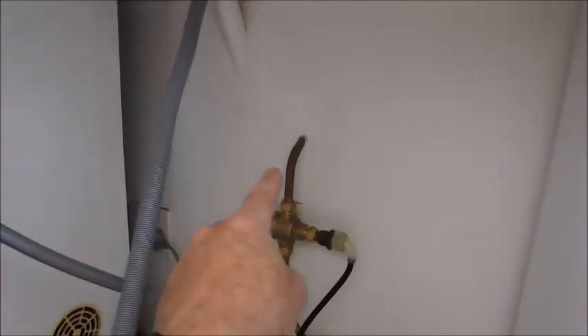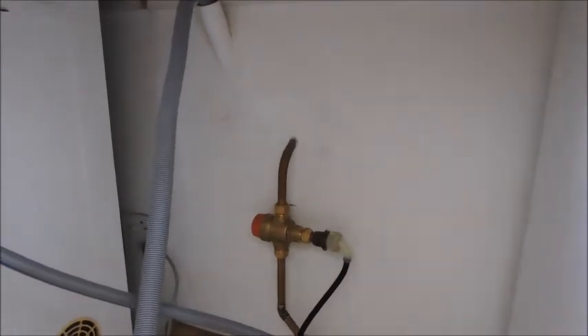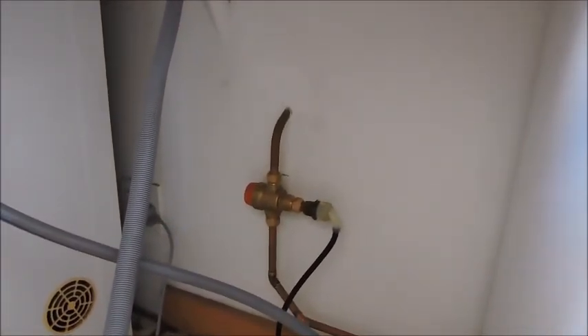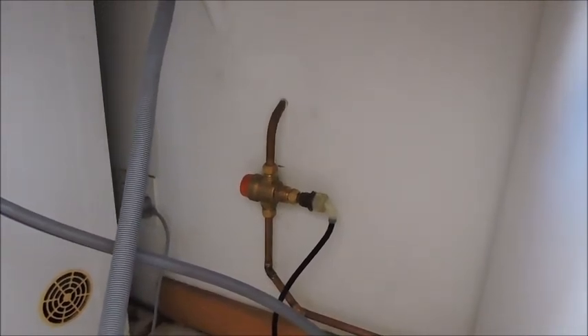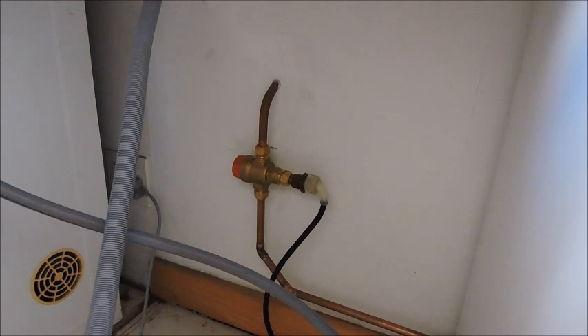Here's the final installation. Cold water feed coming in the top, hot water feed coming in the bottom, and the take-off for the washing machine. I'm going to put a T-junction there for the dishwasher as well. I've plumbed in a copper pipe with a stopper tap that goes up into the roof and is plumbed into the geyser. One thing to be aware of is you need a balanced feed — my first connection I was using mains pressure on the cold feed, not realizing it wasn't balanced, and it was forcing the water up into the hot water system. So it's now supplied by the same pressure balance system on both sides — absolutely essential if you're fitting one of these valves. This is preset to 40 degrees, so it will be supplying the washing machine and dishwasher with preheated water. I'll do a final test on the current reduction in consumption.